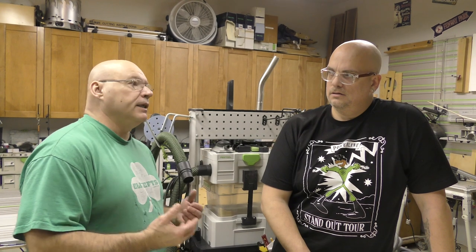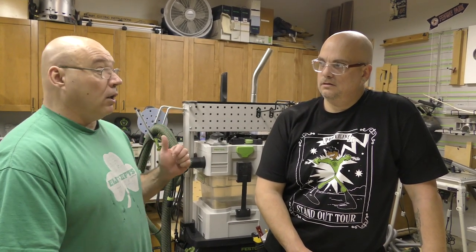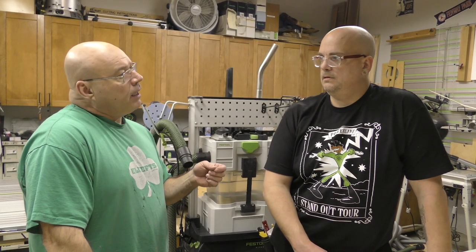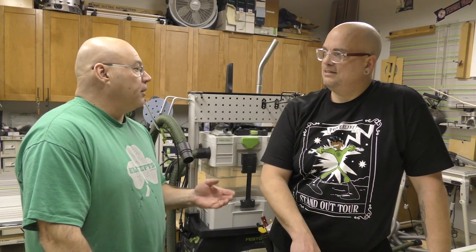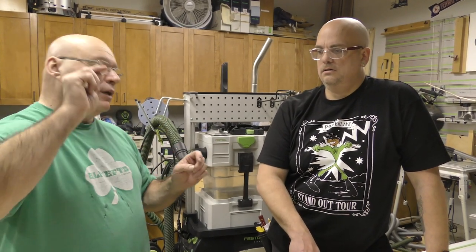It's a variety of reasons. One, when we do an external toe kick, we're not going to use it for this wall cabinet. Let's say we're doing a base cabinet. But we're going to rip 100 millimeter strips for our spanners, and those are the stabilizers that we screw into the wall or screw through into the wall.